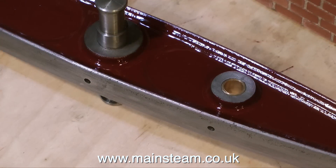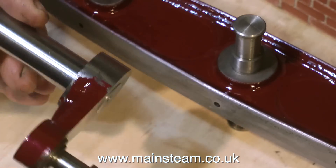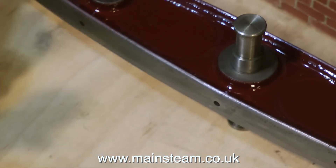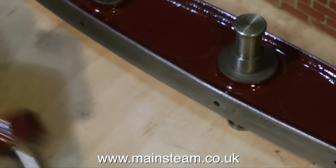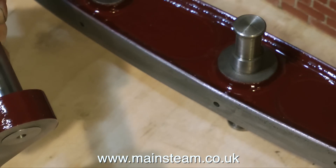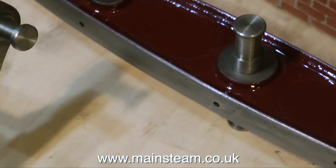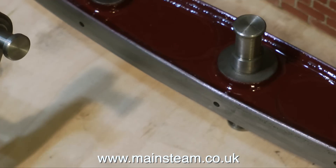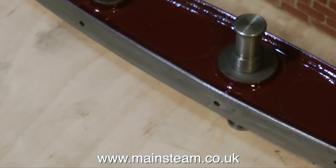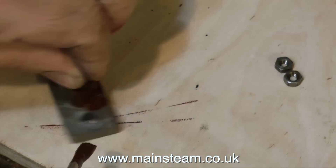After this comment I got a really informative email from a viewer. The pattern for the beam itself is in two halves down its length, and unfortunately the halves rarely line up, hence the offset from the bosses one side to the other. The centres of the bosses are not spaced as per drawings, probably due to casting shrinkage. So the builder has a choice: either put the holes correct to each other, which keeps the engine dimensions mechanically correct, or put them in the visual centre of the bosses and take a chance as to how well it will run. Another problem with the casting, looking down the length of the beam, is that most of them are slightly banana shaped. All of these problems stem from a crap pattern and shrinkage.